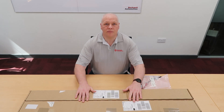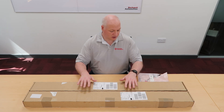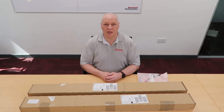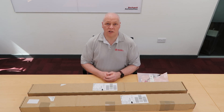In front of me here I have some light curtains which were ordered and have just been received. We're going to do an unboxing. The first thing to note is there are two boxes. The 450L is different from other light curtains — it has a unique transceiver design, so each light curtain stick can be used as a transmitter or a receiver. Traditional light curtains are bought and sold in pairs, so you have a transmitter and a receiver.